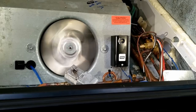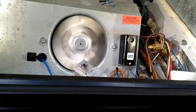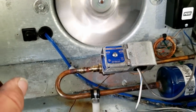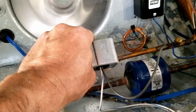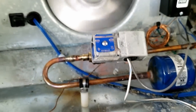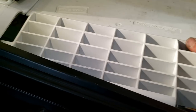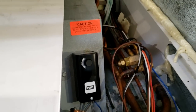I think both coolers are going to go into defrost at the same time - it's going to be a timed-off defrost. I was able to get a longer screw to fit that - just put that on top, which makes full use of that without having to send out a whole new solenoid. It's not vibrating or anything. So far everything's running. I've got another call in this town so I'm going to go do that and then stop back later and see how it's doing. It's set at about 36-37 degrees.